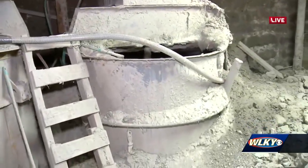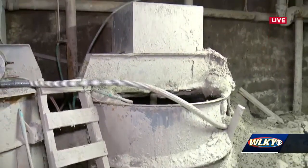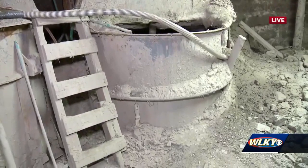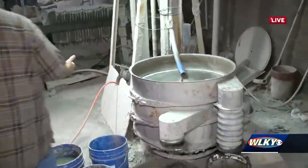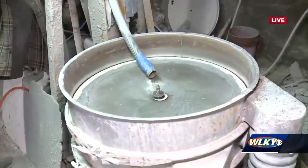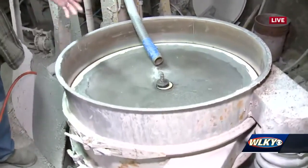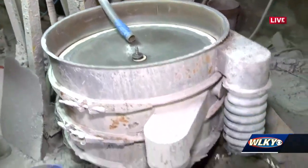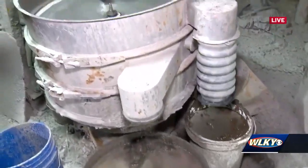So we'll put it in what we call a washer. There's eight paddles in there. You fill it with water. You mix it into a slurry so that you can pump it out and screen it, like when they used to pan for gold, but we're panning for clean clay water. And so you do that here. We'll turn the separator on — it'll be pumping the liquid out. This is a 20 mesh screen, so that's fairly big holes, but the one down there is 80 mesh.